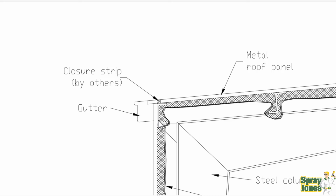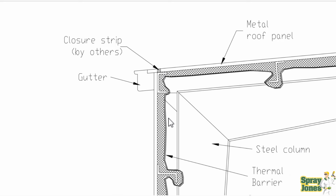Now, when you get into corners and edges, it can be very difficult. You've got a structural C channel or a column or what have you that's in there. Make sure these areas where you're not going to be interfering with gyprock or paneling or tin lining on the inside, make sure these areas are fully embedded. There's no reason not to go over them. You're not entrapping any moisture into the system, so get the flanges and all of the necessary metal sealed.